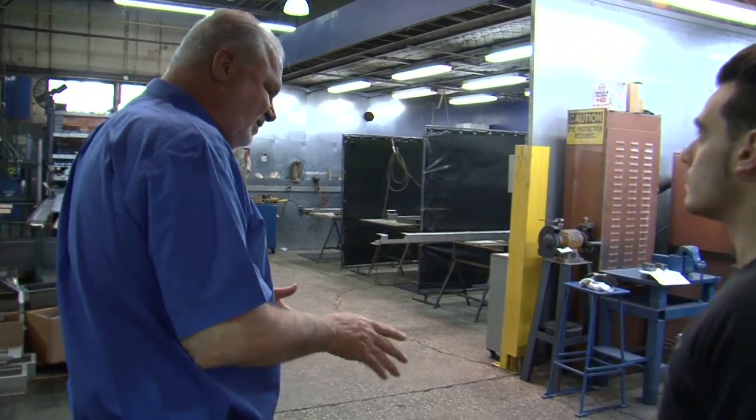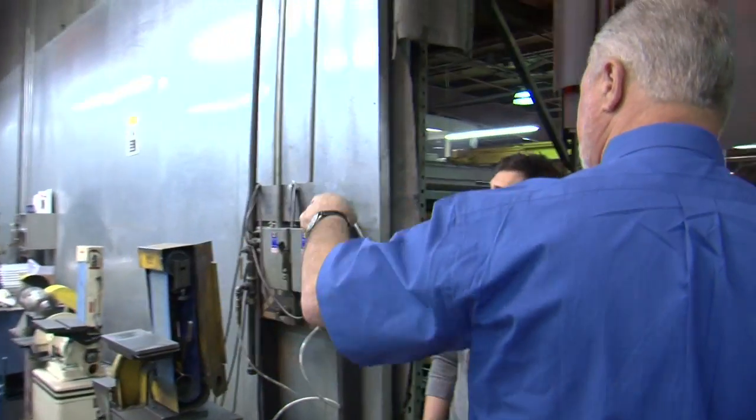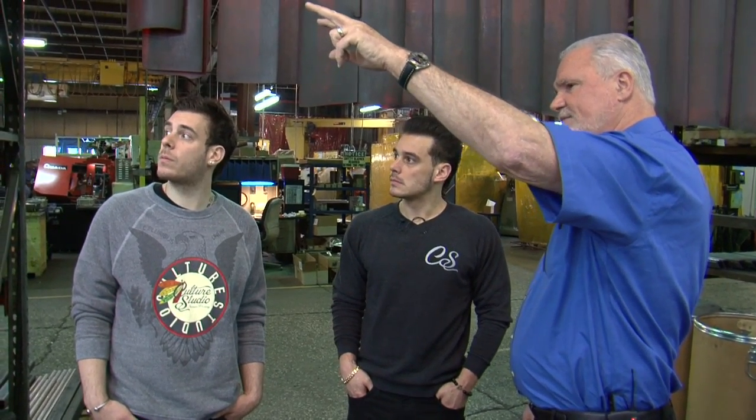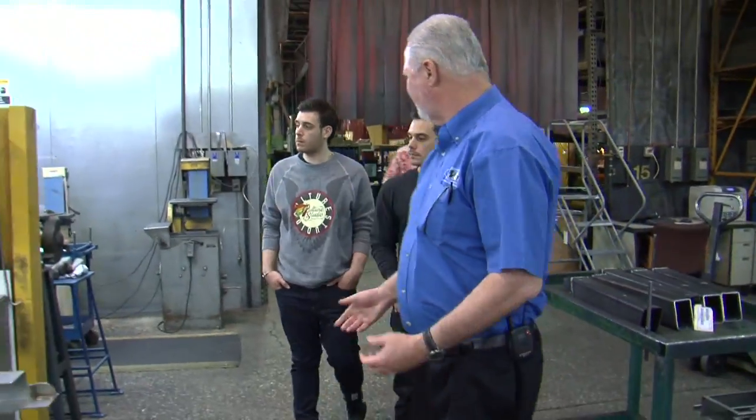We're kind of clean fanatics, so here we put metal walls because he's doing aluminum buffing. When you do aluminum buffing, you don't mix aluminum and metal together — possible explosion in buffing. So they'll buff down in this area and the walls are made of metal so they can brush them down at the end of every shift to keep it clean.